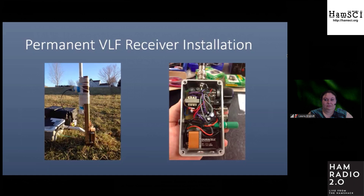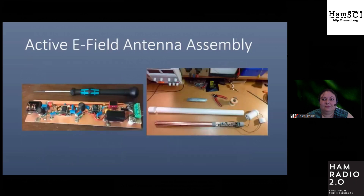It allows for live listening and recording on a hard drive. Because VLF receivers require an earth ground for sensitivity, 50 or 60 Hz mains hum can be injected into the receiver from a PC sound card or power supply. For VLF audio, a minimum of two audio isolation transformers are required to prevent mains injection, but the VLF receiver still has to be powered by a battery. In this project, a VLF receiver powered with a regular power supply is used, made possible by an audio isolation transformer and an isolated DC to DC converter operating at a frequency much higher than the VLF band.